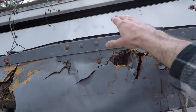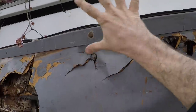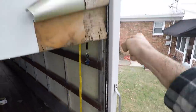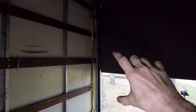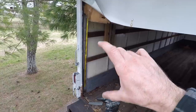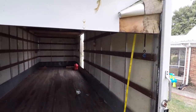Here's the plan. When I pull on this right now, you can see the springs are both pulling down — there's a lot of tension, but the spring seems to be working fine. I'm going to hook up a ratchet strap to wherever the cable latches on each side and pull it down and attach it to the vehicle so the cable can sit on its own, releasing all the tension from the spring. I'll remove the bottom two damaged panels and replace them with a single plywood panel. I'll coat it with aluminum sheeting so it kind of matches, and we'll just have a single panel at the bottom instead of a dual panel.